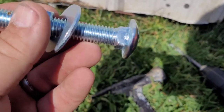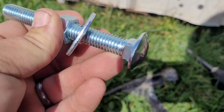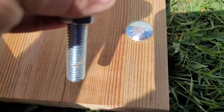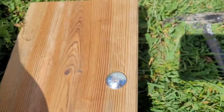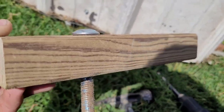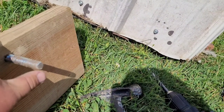Your carriage bolt is going to have — it looks like a nut on the inside of it, so the head is flat and you can't get a hold of that with anything. Take your carriage bolt, put it in your hole, take a hammer and beat on it, and the nut part will be down in the wood. That's going to hold your carriage bolt while you're tightening up your nut on the other side.